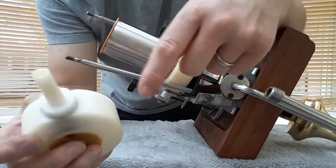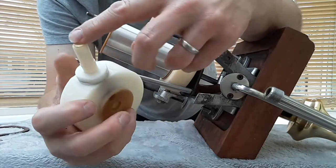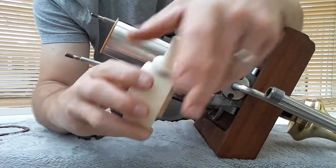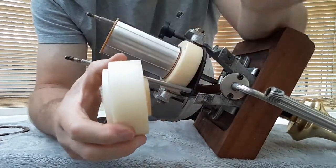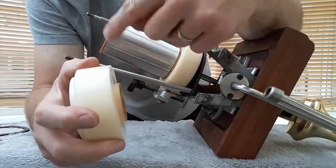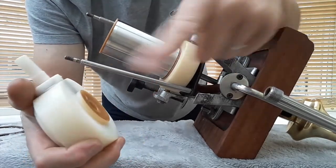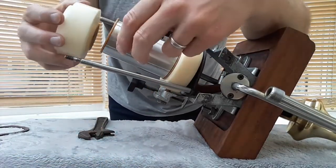Now remember, obviously this is the supply line coming in. This faces at the back, so this doesn't face forward in this direction. It's going to face backwards, which would then disappear under the bar counter connected up to your line. Otherwise your line will be at the front here where you're trying to pour a beer. So that goes to the back.